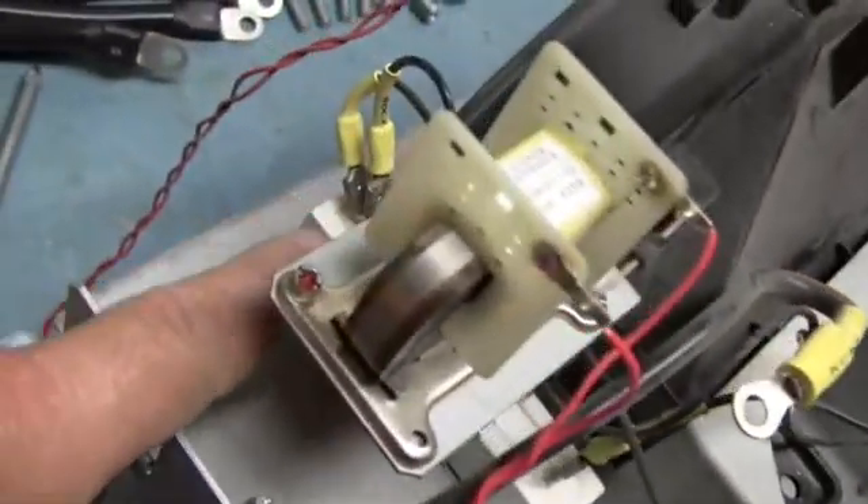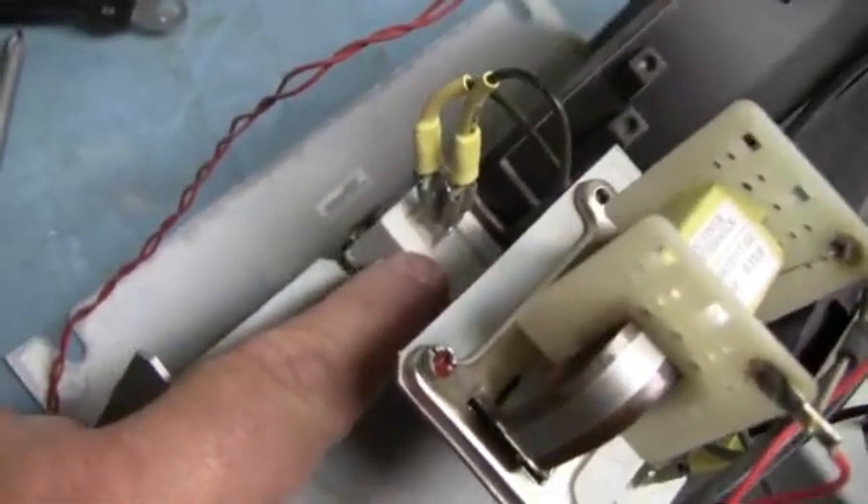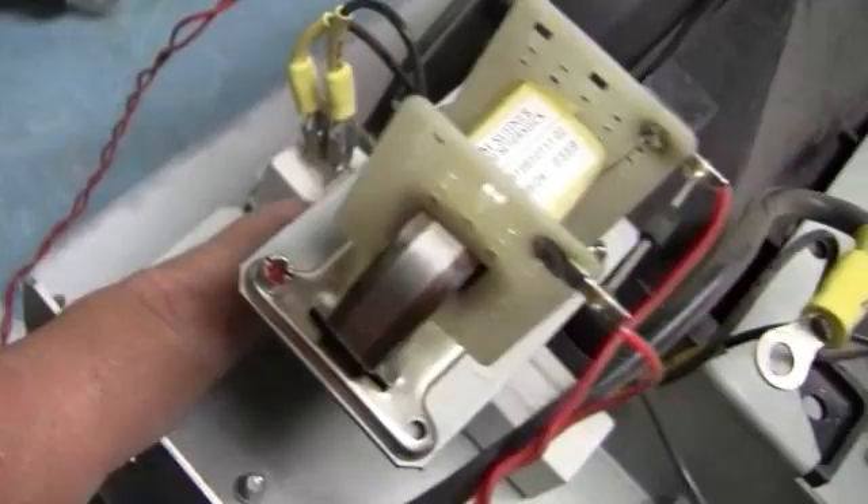So it's basically across the bus when this contactor is de-energized. It'll close the circuit, and that's what this resistor is for — it's to rapidly bleed down the bus for a fault code issue.